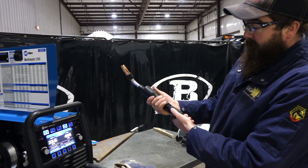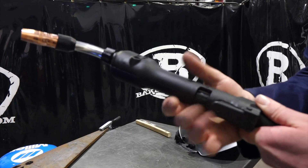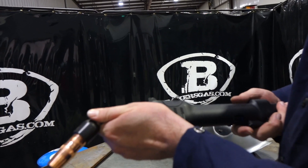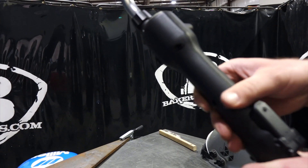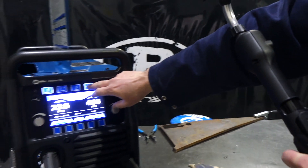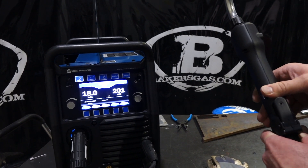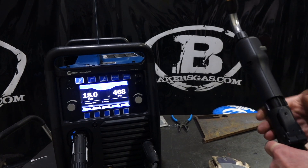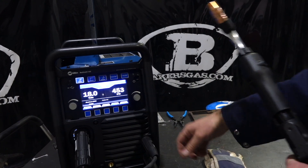The trigger is on the bottom — not my favorite feature, because I keep hitting it every time I go to grab it and it keeps feeding wire. But it is nice when you're welding because you can almost two-hand the whole thing. The wire feed speed control is also on the gun. If you get out of Autoset and just move the control, you can go up or down on your wire feed speed right there — you don't have to walk back to the machine.